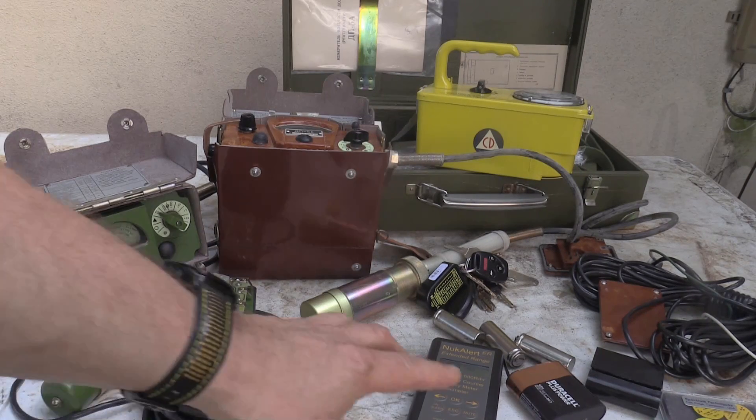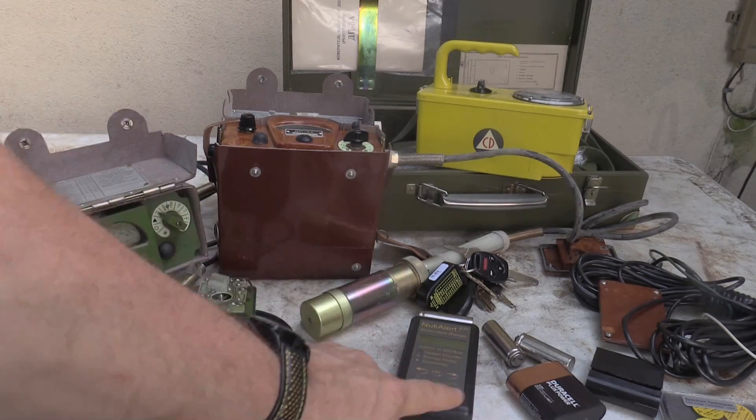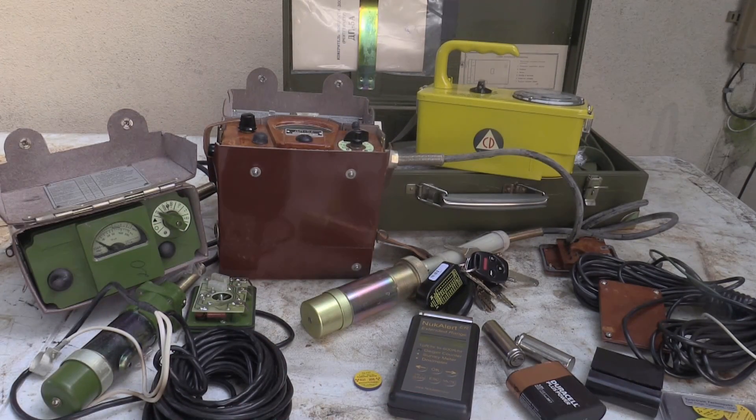What Shane did for his devices is he figured out that if you turn off the tube, turn off the electronics, and keep turning it back on and off, you can actually measure how quickly the tube saturates - or time to the first click - and that's how you can measure the higher rates using a regular GM tube. That's why this device - if you can afford it, I've done an article on it before - being aware of recent nuclear leaks in Miami and New York and how quickly they're covered up, it is a great investment.